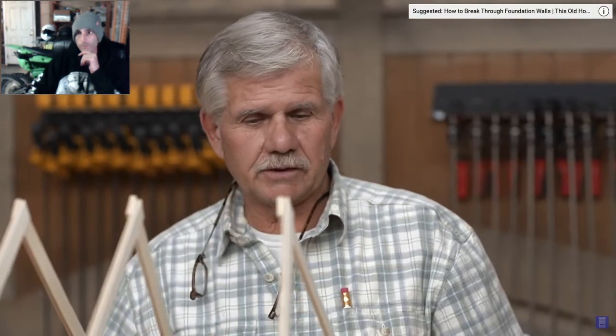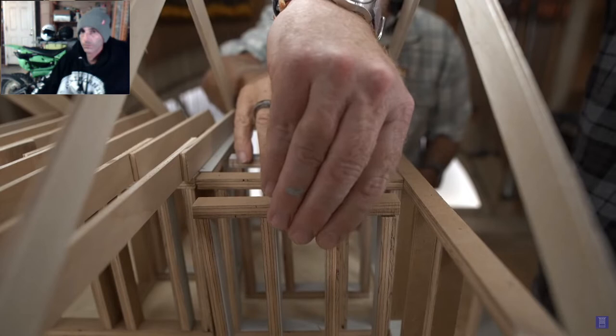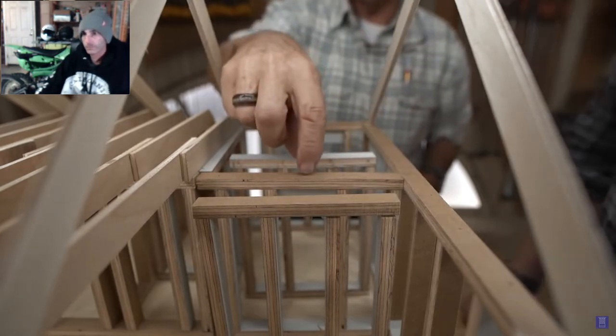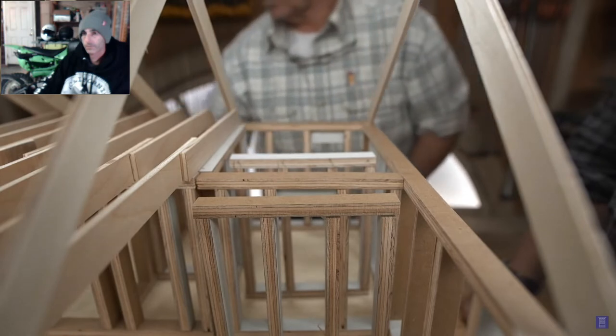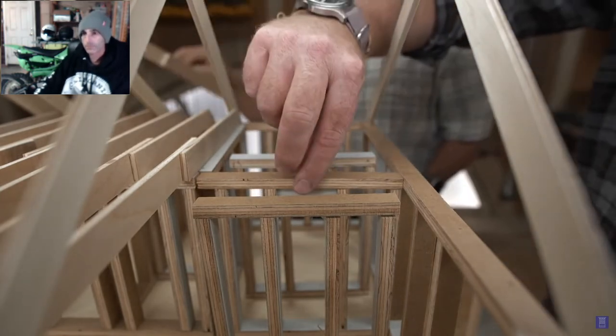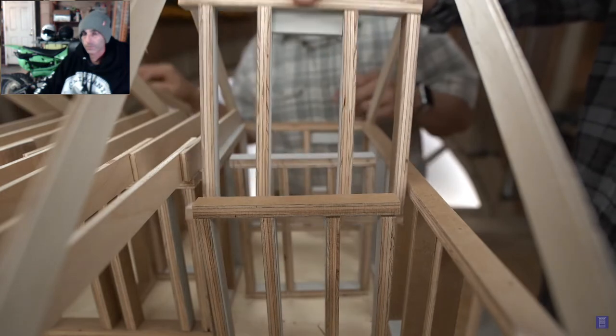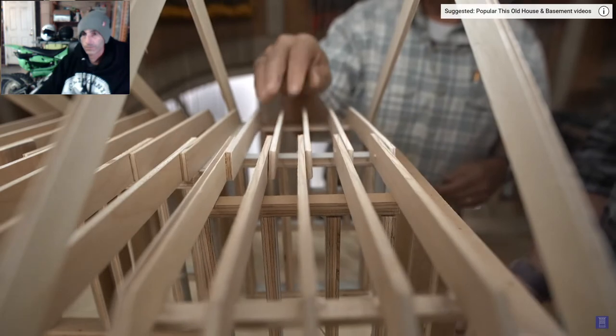All right. The first thing we need to do is we've established that it's a load-bearing wall. We now are going to build a temporary wall close to the structure wall, but far enough away so that we can work on the structure wall and remove it. And obviously something that we would build when the ceiling was still in place, we could do that. Okay, so now it's in place, we can remove it. And what's going to happen to our ceiling in that situation? Well, in this case, our ceiling is temporarily supported.